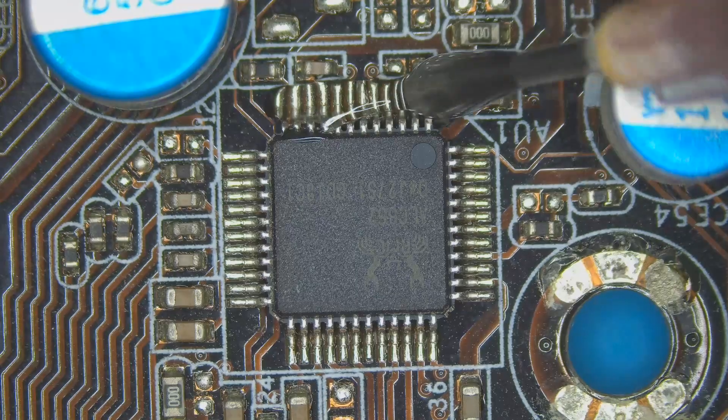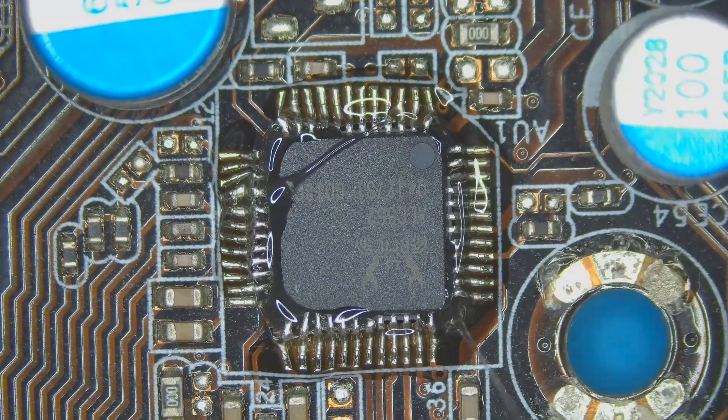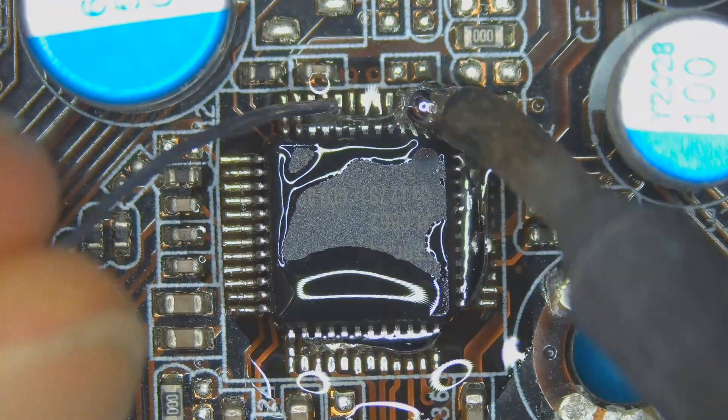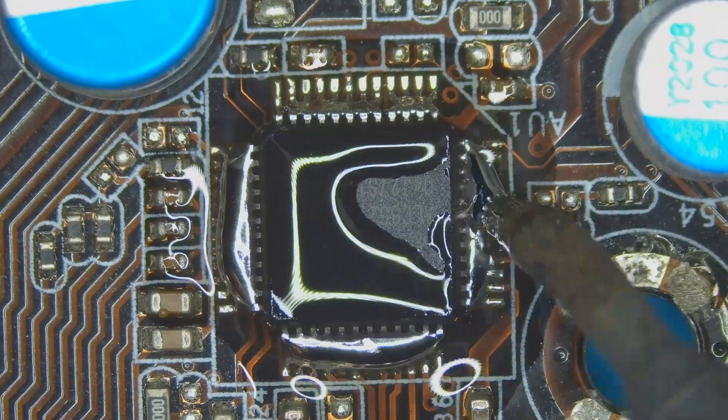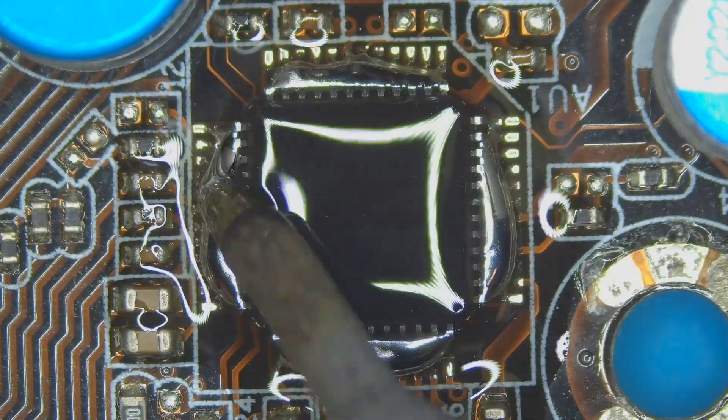In the past I would have tried to get fresh solder on the pads with plenty of flux. And by the way, always use flux - it helps the solder flow, it's magical. Afterward I would try to heat all the solder joints around. But this is impossible because the heated joints will cool down way too quickly to heat them all at once. It is like trying to catch smoke with your bare hands - it's hard and frustrating.